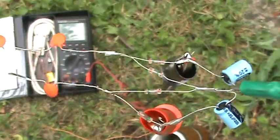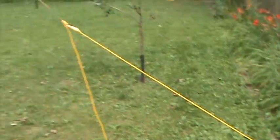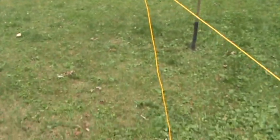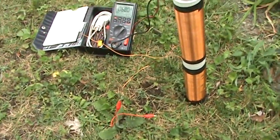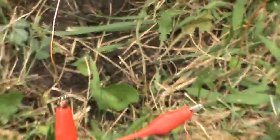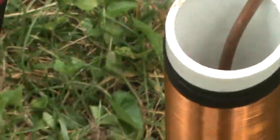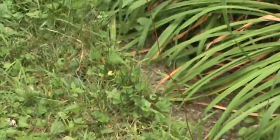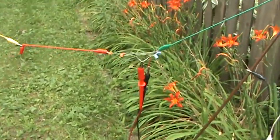There's the diodes — one circuit. There's my antenna again. This yellow one is just kind of holding things taut, but my antenna is the green one coming down to the two coils. It actually goes to the bottom coil. The end of the green wire comes down to the top of one coil, then the bottom of the other coil comes out to the red one, which connects both of them. The red one goes into the bottom of that one, and the top of the coil comes out — so both coils are in series. That goes up and then to the circuit, so the two coils are in between our circuit.